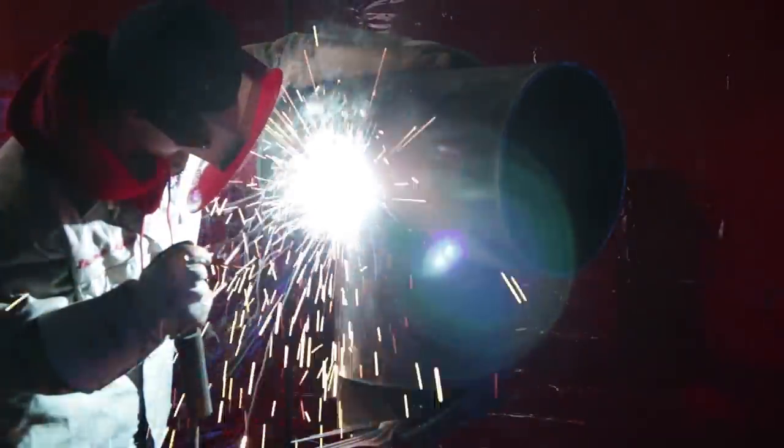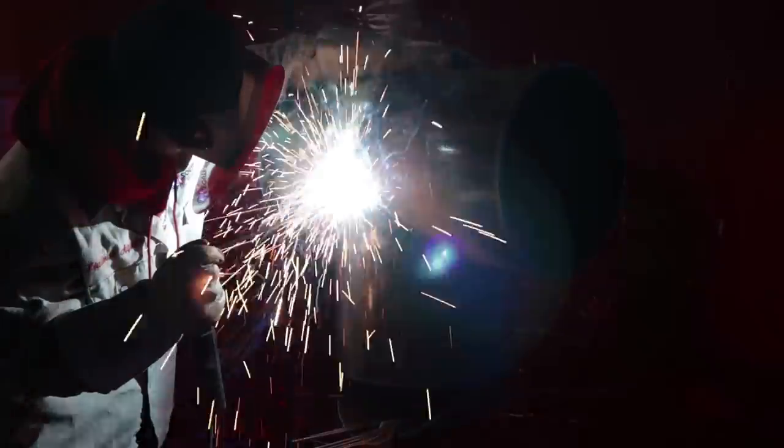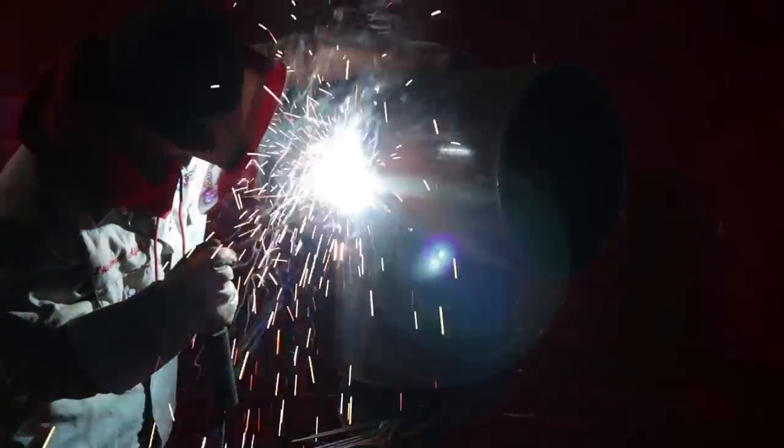All right, now I'm starting the fills, guys. I'm still using a 532 8010 pipeliner rod, and I'm still running at third gear, but I turned up to 60, went up 10. Still using the same whipping method, but I'm going a little bit slower so I can let it build, okay? I don't wanna go too fast. I wanna let it build so it can flush out a little bit quicker.